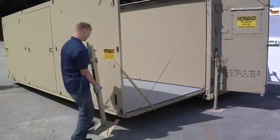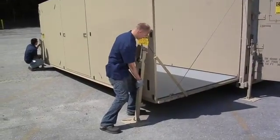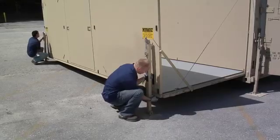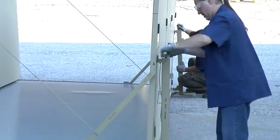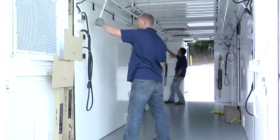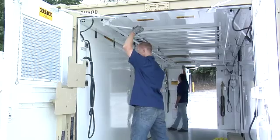Remove 2 leveling jacks from inside of the left cargo door. Adjust the height of the jacks by rotating the top handle until the jack lift pin engages with the floor socket and the jack hook engages the jack support bracket on the sidewall. If needed, jack extensions are available in the equipment container. Push both handles of the solar bar simultaneously to slide the hinged roof outward.